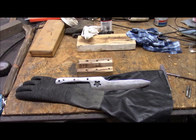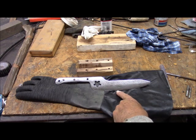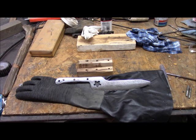You see here the effect of the redesign, and I like the redesign considerably. Yeah, I think that's an interesting shape and one that will be very effective once I get it properly hardened. But right now on the cutting edge, I'm getting little small feathers, which again is the indication that the steel is not sufficiently hardened. So, on another day, another time, we're going to re-harden it and finish the knife, but not today. So we'll end this video with a redesigned knife, but not completed.